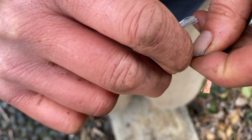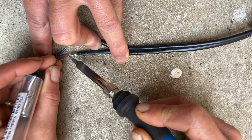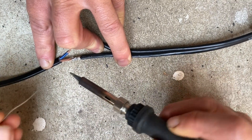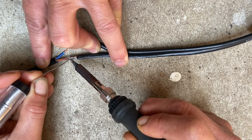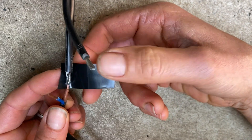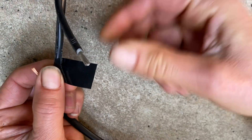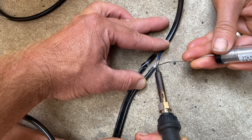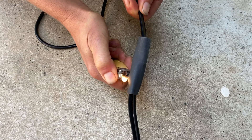In the past I've even just twisted the wires together and then covered them with electrical tape. Basically, all we need to do is allow the electricity to flow — make sure you match the positive with the positive and the negative with the negative wires. The cable we're using here had writing on one side, so we called that the positive. Once the wires are joined, we use some electrical tape to cover the exposed wire — we can't have the positive and negatives touch. So we soldered the negative wires together, taped them up, and then added a shrinking insulation cover over the top.